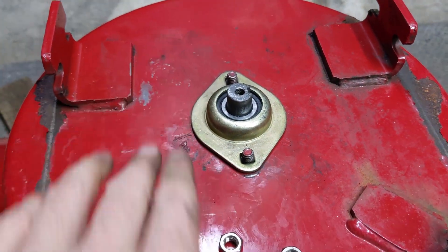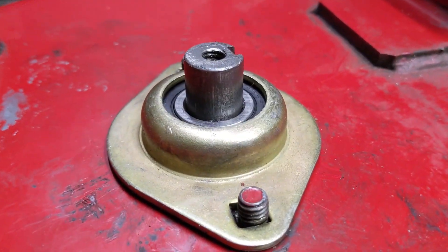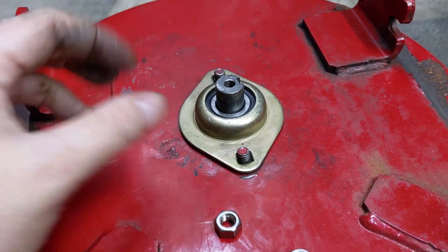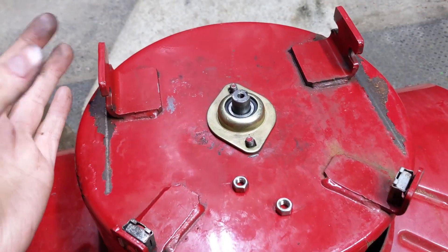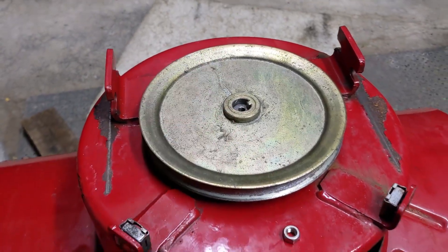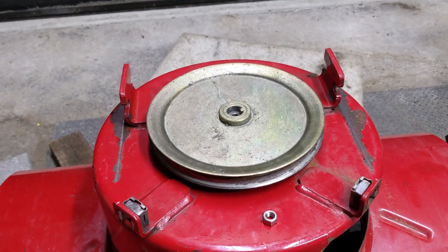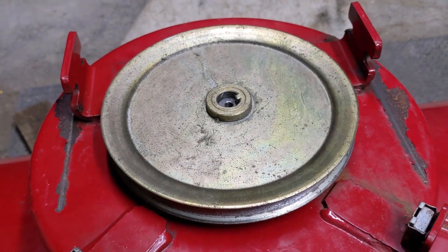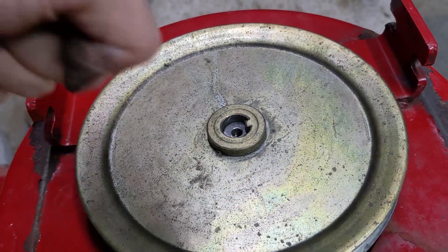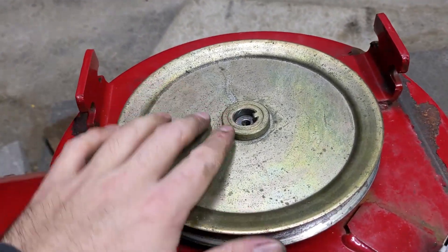I wanted to bring you back to talk about blocking up the gearbox. If you lift that shaft up you'll see just how much it's moving up and down. Ideally you want to get your bearing flange tightened down first, then block up the gearbox, and then put your pulley on with your bolt. If you try to put the pulley on without any upward pressure on the gearbox, you'll notice a large gap, and if you just put your bolt and washer in and start tightening, you're going to snap your bolt long before the shaft pulls up to near flush with the pulley.